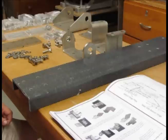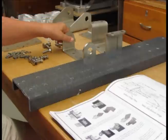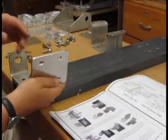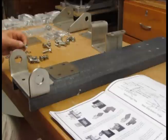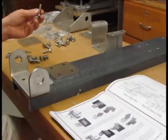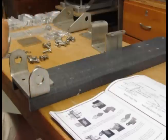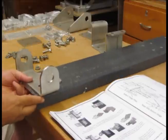We're going to start off by installing the bottom hinge plate, which is at the bottom of this composite channel. The bottom hinge plate is attached with four bolts. There are pre-drilled holes, and there's a backer plate made of substantial metal. There's certainly nothing lightweight about this whole installation. From the assorted hardware, I've selected the appropriate bolts — 3/8 inch carriage bolts — and they go through the plate in the bottom and up under the channel and through the plate.